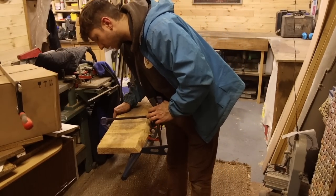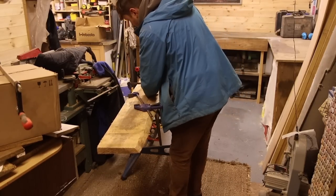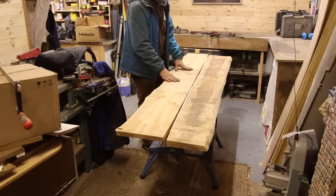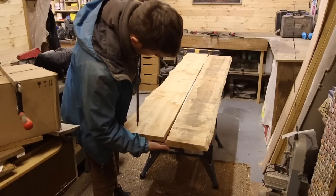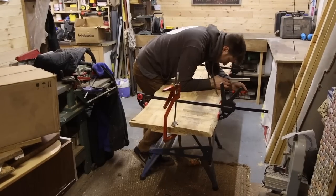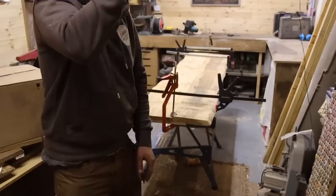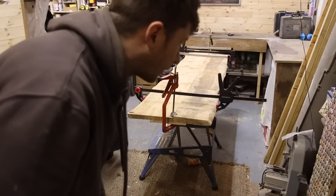I don't think the tongue, if you will, or biscuit, is dried completely, but I don't think it's going to go properly until it's all compressed together anyway, so I'm going to risk it. Just trying to do it all now. The test run first. These are the sides, so these are the backs, but because I routed from the faces, the router will do an equal amount from that side, whereas the bottoms might be slightly out. It's definitely going to need some more reinforcing just to stop it swaying so much. I'll figure that out tomorrow, see how it dries.